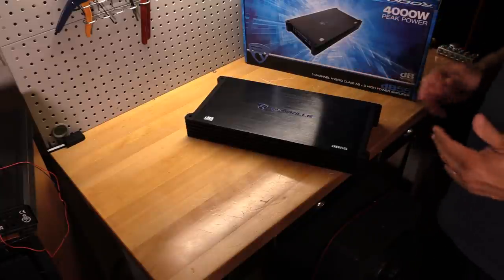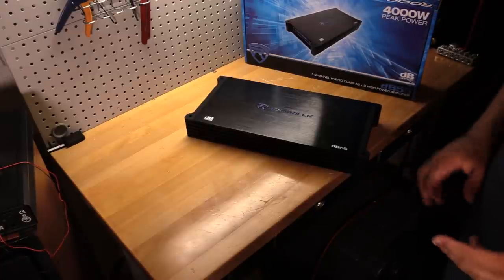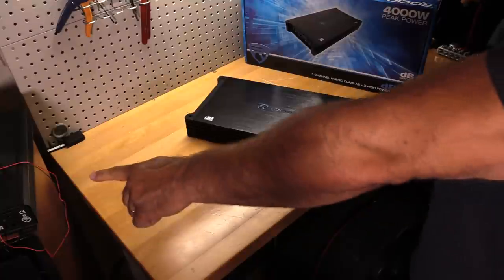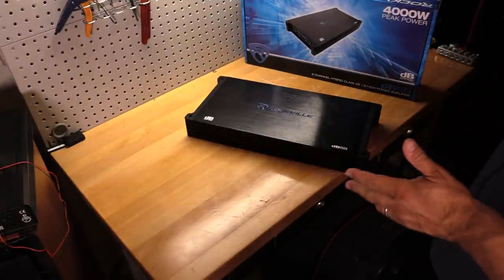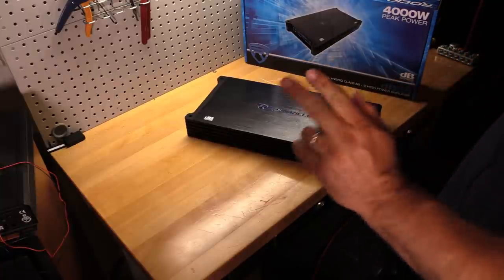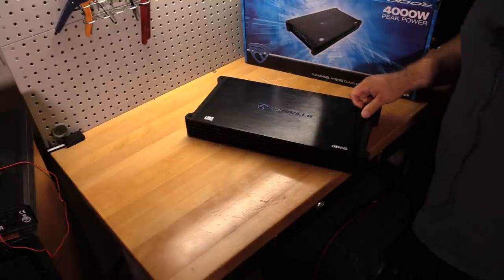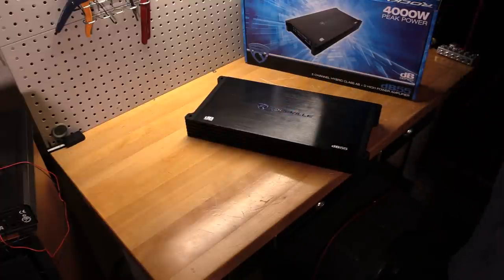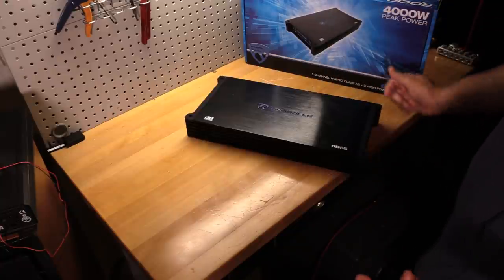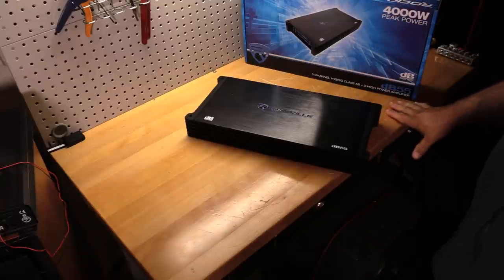I did tests off camera that you're not going to see because it's kind of boring, and quite frankly I'd have to pay copyright on stuff, but I did run it to a 2 ohm subwoofer, and I ran it to a pair of, well, these speakers here, which are Triangle Celius 202s. I ran the 4-channel section bridged, so both of those were bridged at 8 ohms, and it sounded awesome. So very nice job by Rockville on this amplifier. And again, for how much you spend, I think it's between $159 and maybe $175 right now. I think it's a really impressive value.